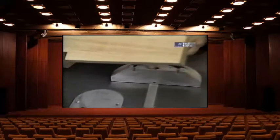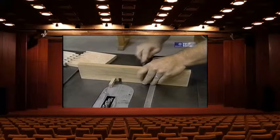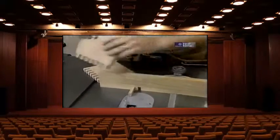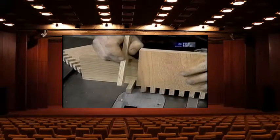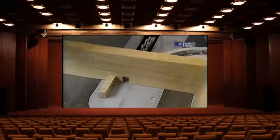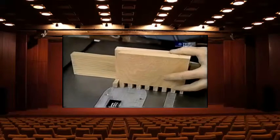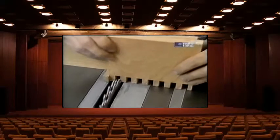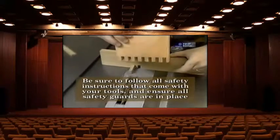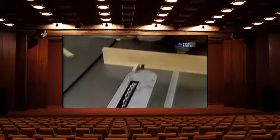Using your T-square, you fashion the jig to it with a couple of screws. The first cut is made with a 3/8 inch thick guide stick placed up against the pin. Slide a piece of material in and make that first cut on one piece. Then butt that piece up against the pin, take your next piece without the guide stick, slip it up against the pin, and pass through — it cuts both pieces at the same time. After each pass, move over one slot, drop it down over the pin, and make the next pass. When you're finished, you'll get two pieces of wood that fit together perfectly — a joint that very few others are stronger than.